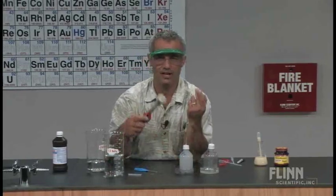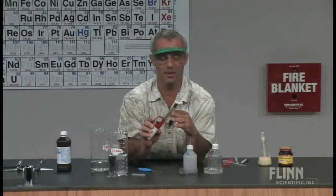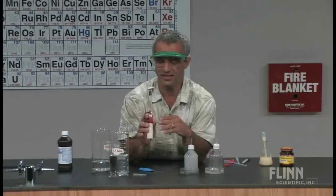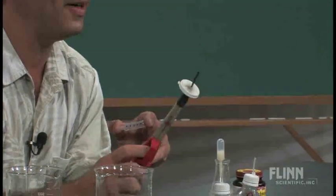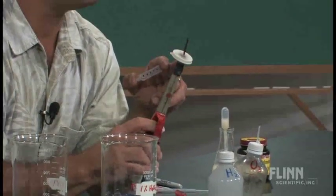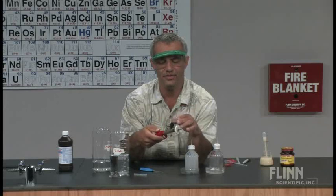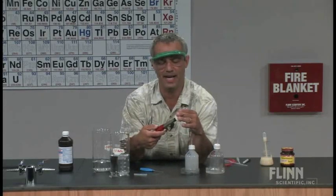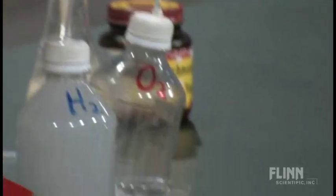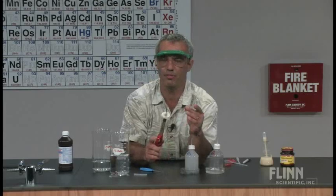What can I do with this? Well, one thing is try to ignite it — hydrogen is combustible, right? This is a butane lighter that has actually run out of butane, but the piezo crystal sparking mechanism still works fine and works indefinitely. I stuck a piece of speaker wire down in there, put some hot glue behind it and a little film canister cap on top. If the camera can zoom in on the tip, you'll see a little spark jumping across there — a tiny spark.